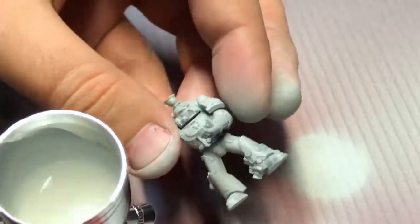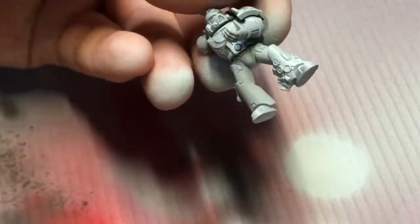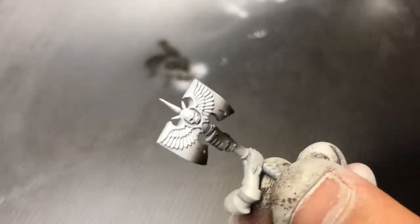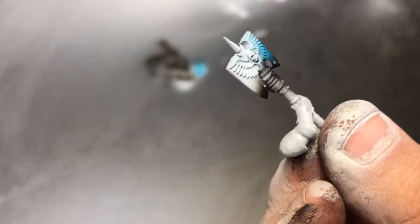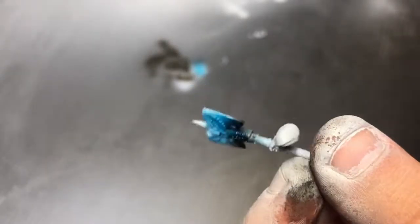And also going off of the 3 litre tank, I'd argue that going to either a 15 or a 24 litre tank, especially since the price increase on the Bambis isn't that much for a larger tank. If the motor runs for, say, 3 minutes to charge up 24 litres, or it runs for 2 minutes to charge up 3 litres on a poxy little cheapo model, the Bambi motor will be running a little bit longer, but it'll have a long breathing time in between sessions of generating to cool down, and hopefully that'll make the big difference. But, you know, it's a gamble, as with all these things. You don't know how good something is until you've got it in your hands.